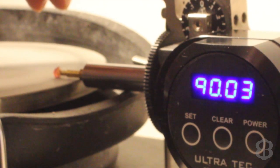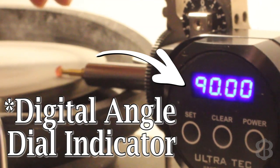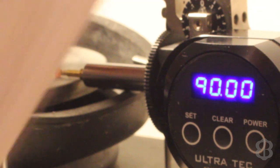You can see the index gear jumping. That means the stone's touching the lap. So right there, and if you move it, you can hear it. It's just above touching the lap. So that's going to be good for the 90, and that's going to take care of cutting it right here on this facet first. And then all the other facets, we won't have to adjust the machine at all, and